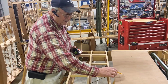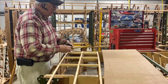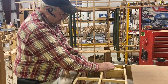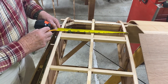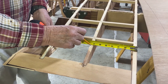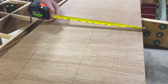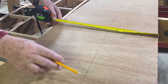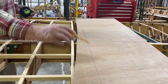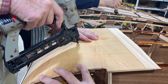The next step is to lay the lines down on the plywood from which we will nail into the step ribs. Come up here, measure the center of the center rib and note the distance. Then bring your tape measure all the way over, find the center of the boxed root rib, and note that distance. We come down to the end of the structure and note that it's the same on the front, in the center, and on the boxed rib. We lay those distances on the step plywood and scribe a straight line. We have the marks here and here, and we've scribed two straight lines. We do the same on the center piece — a straight line. These will be the lines that we nail down.